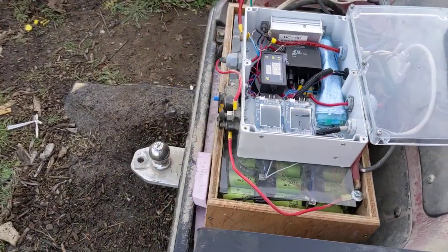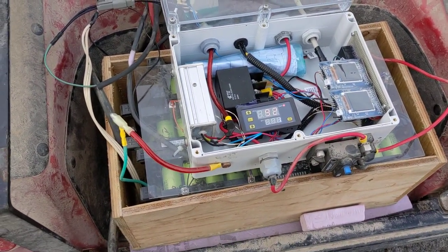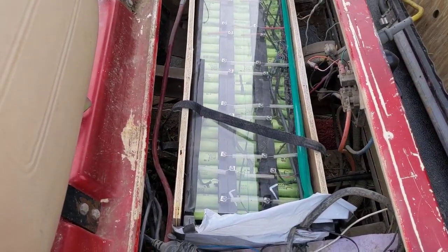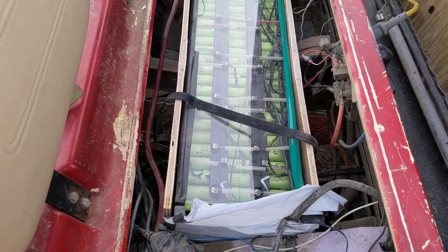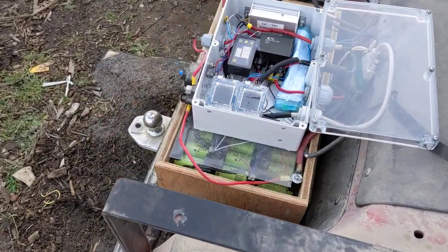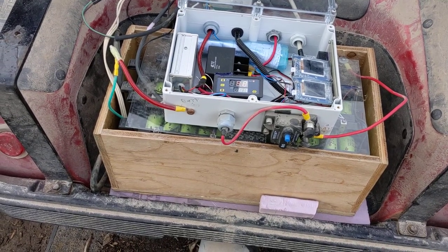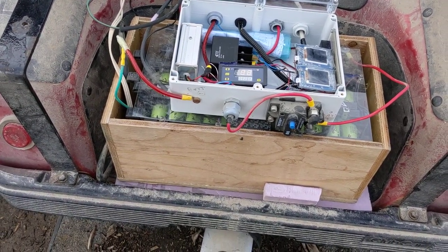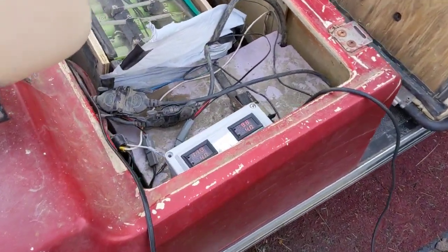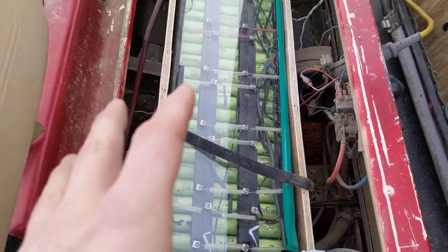I'm in it today to do a retrofit for a heating system. Not very many people fully understand lithium-ion batteries — I'm not perfect either. But as far as I understand, these cells work just fine below freezing temperatures. However, what's not in the data sheet is that if you charge them below freezing, you can damage them. They'll discharge just fine — that's what they mean by operating. If they're charged up in an above-freezing environment and then dropped down to -20 or below freezing, they'll be just fine. But as soon as it passes that threshold of zero degrees Celsius, you're asking for trouble. So what I'm doing today is installing some thermostats — one for the internal battery pack and one for the rear battery pack. I've just crammed batteries anywhere I could on this because they're so much lighter than those boat anchors.